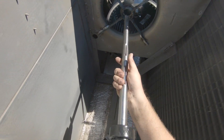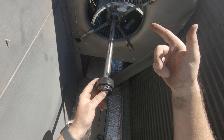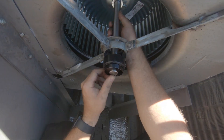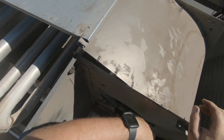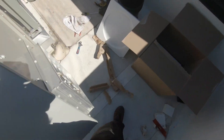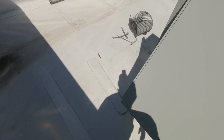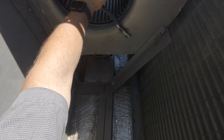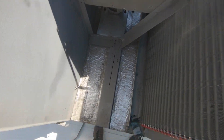Now we need to shove the shaft in through here and go through the blower wheel, then put the bearing on the other side and then the pulley. We need to get our bearing seated in there, making sure the shaft is coming through the hole on the other side — want to make sure it's aligned properly before shoving it all the way in. There we go. Now we need to go ahead and put the other bearing in on the other side, then slide that in all the way.